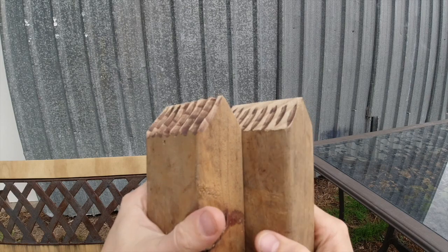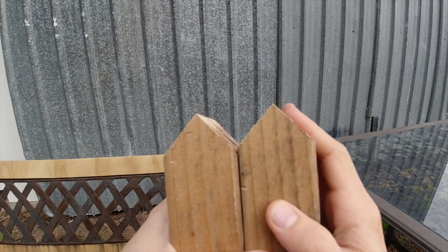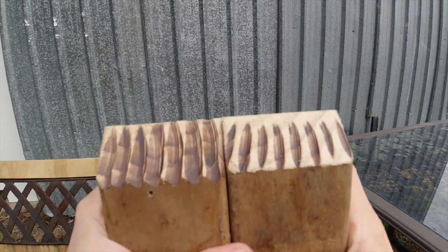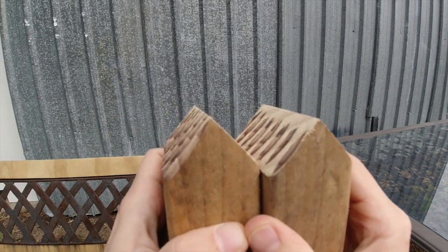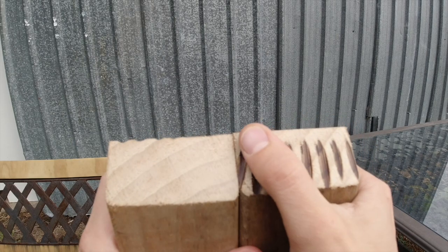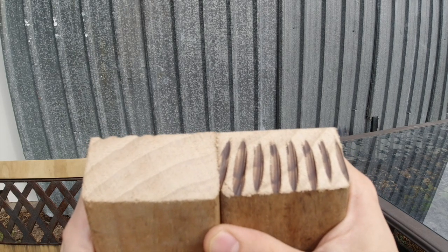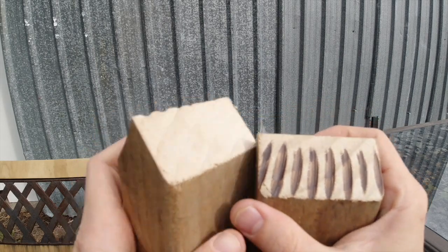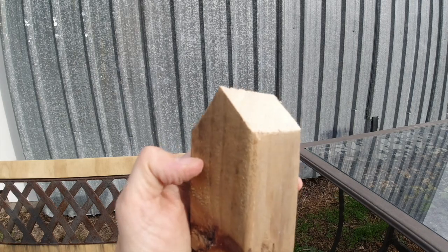This one's pretty easy to see with the naked eye. The forces that abrade the surface as a whole — rather than compressing the tip — probably have a fairly normal effect on a dual grit edge. What you can see is it's actually lessening the difference between the coarse side and the fine side; the coarse side is beginning to look more like the fine side edge. My guess is that general abrasion forces don't have a specific effect, but the mechanics of apex wear do have a specific effect, as we just saw.